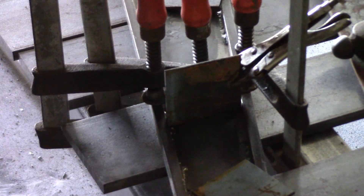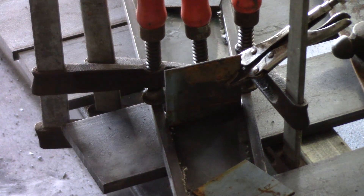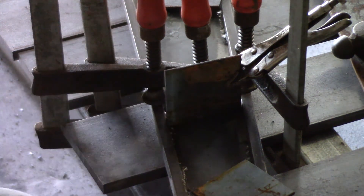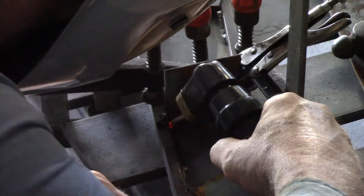The welder's ready. It doesn't matter what sort of rod you use to tack this up with. It's non-weight bearing — it's just to make sure we can get the shape form. And apart from the fact that they'd warp around it, it doesn't matter if they fall apart after we get the outside seams welded. I really don't want them warping around in there — it'll just concern me every time the arms move.